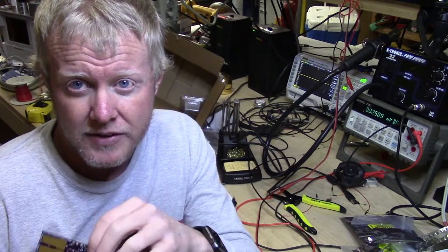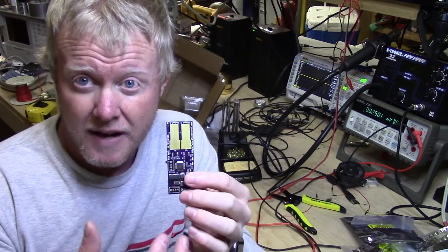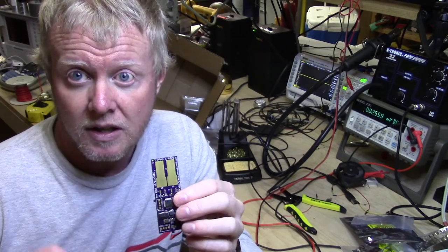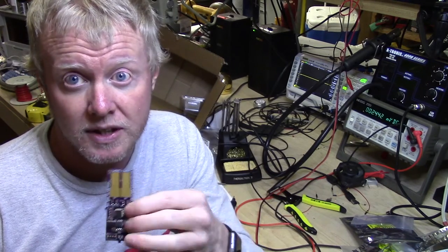I think my default timer on the Polaris is not adjustable that I know of. I'm actually going to extend that timer, so I'm going to have an input into this that actually tells me when I've turned the switch off. But the accessories that are connected to this are going to stay on much longer than that, so if I want to leave a light on.